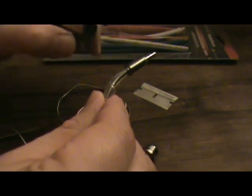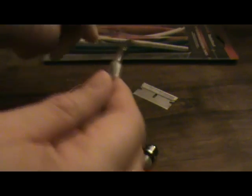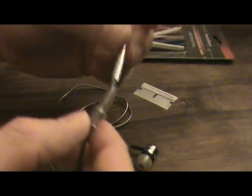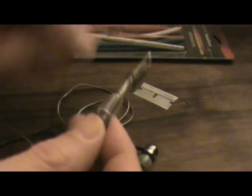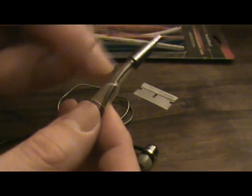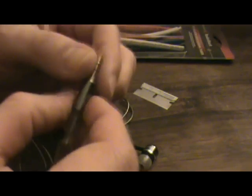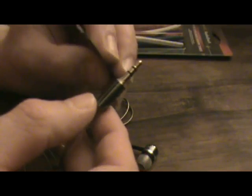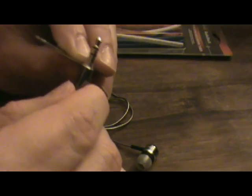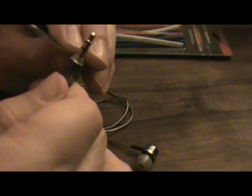Be careful not to burn your fingers either. This actually becomes a little bit sticky as it heats — some do, some don't. And that's now pretty snug. Blow on it for a second and let it cool. The tubing down by the wire probably won't shrink tightly enough to really wrap tightly around the wire, but that's okay because you just want a rigid section to reinforce this and prevent it from flexing right where it meets the hard part. As it cools it begins to stiffen a little bit — it's not nearly as flexible as it was when it was hot. Now I'm going to take the razor and carefully cut away the plastic that extends over the edge, because obviously you can't fit it into your device if there's a little piece of plastic hanging off.